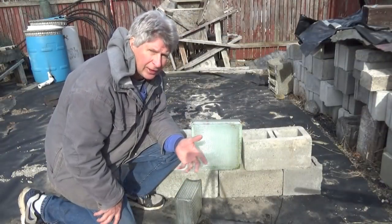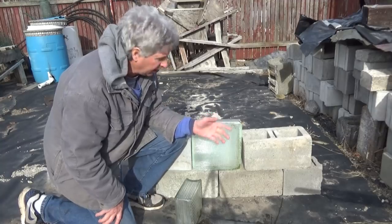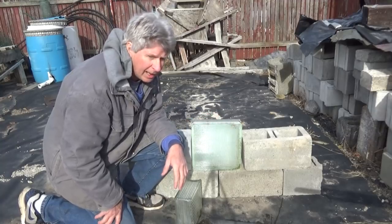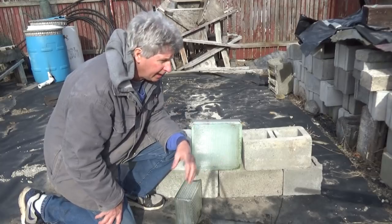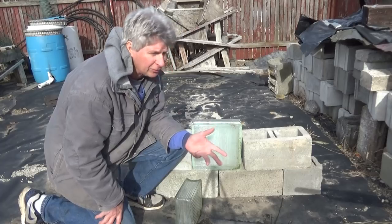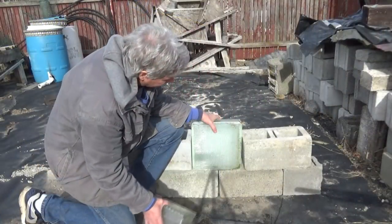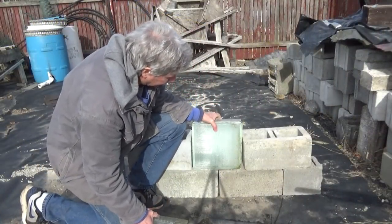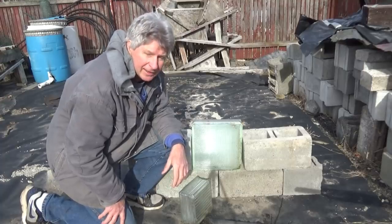So there's not really a lot to say about putting glass blocks in, it's real basic. Just like putting in brick or block or stone — just put your cement down, you put it in, that's it. I use a fast repair mortar, it's almost as fast as rapid set, gives you a little more time, and you can get glass blocks in any type you want. They come in a lot of different sizes. Thanks for watching, I'm Mike Haduck, until next video.